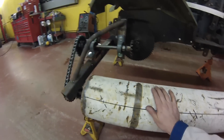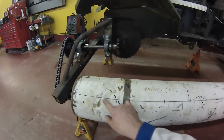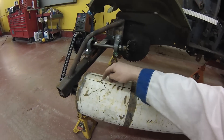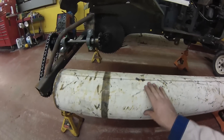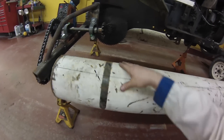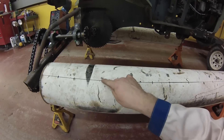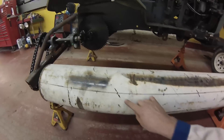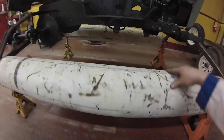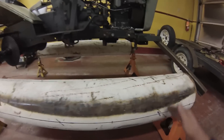On the pods themselves, I've marked out — first of all, I put a line quarterly, dividing it into four quarters, and then I marked out my eight-inch segments all the way along, staggered up another four inches. You can see here basically how my screw is going to go along. I'm going to make sure that each time I tack that loop on there, it's going to hit one of these marks as I go — and you can see that's basically going to give me my helical pattern, hopefully.